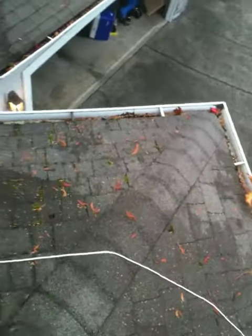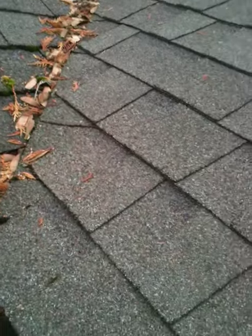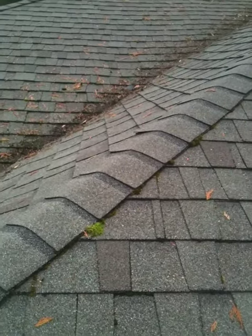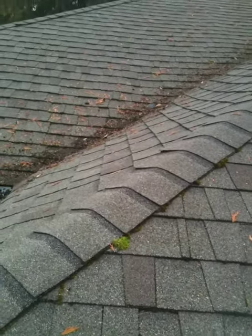This area of shingles against this wall, and anywhere the tacker staples went in over here — this style of valley is notorious for causing leaks. In some areas of that valley, the shingles are only about 8 inches at most onto the other side for the weave.